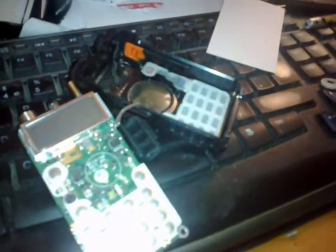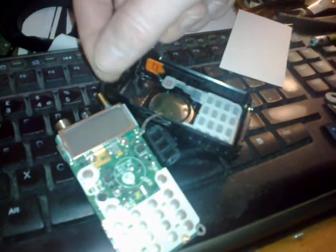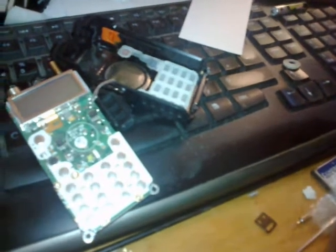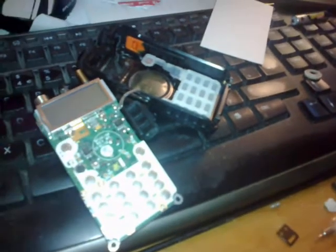It wouldn't hurt to blow it all out and dust it off every now and then to get all the dirt out from inside. The problem I had was the volume control needed some switch cleaner — it was very crackly and a lot of dirt was getting in there. I'm going to need a washer to go underneath the volume knob to stop stuff getting in there. I've got one for the antenna to stop crap getting in there too.